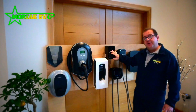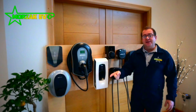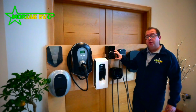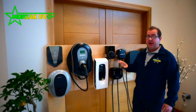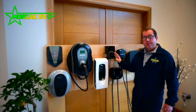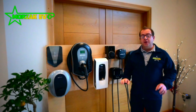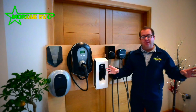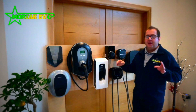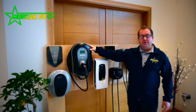Obviously you need to think ahead about what you might be doing in the future with your EVs. If you don't understand the difference between Type 1 and Type 2 sockets and the history behind it, make sure you check out our video in the card above. Finally, the last reason you might go for an untethered unit with a socket is if you need a super long cable — we have had customers who bought 15 metre long cables, and you're just not going to get that with a tethered charge point.